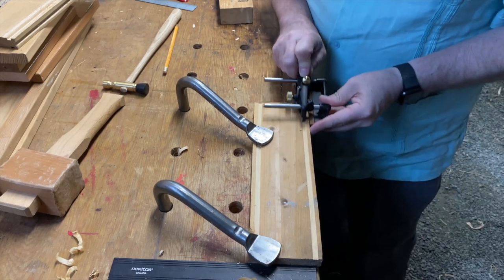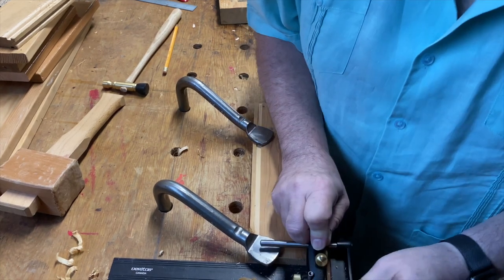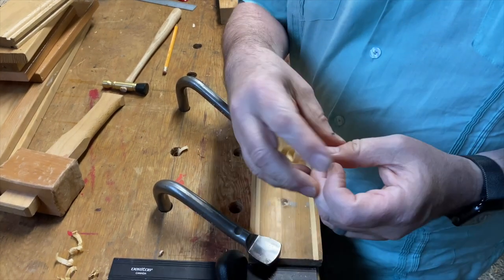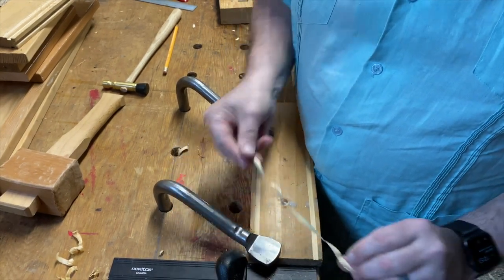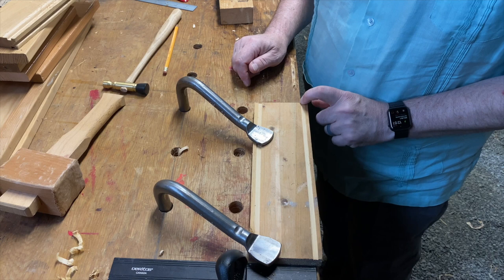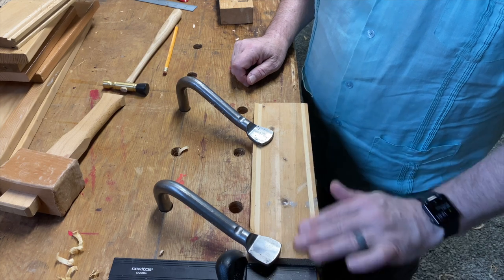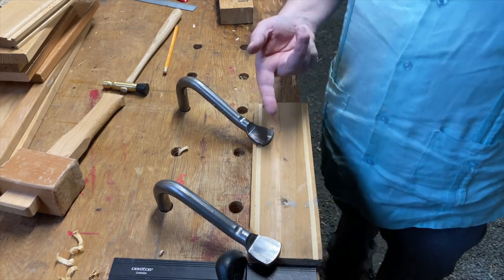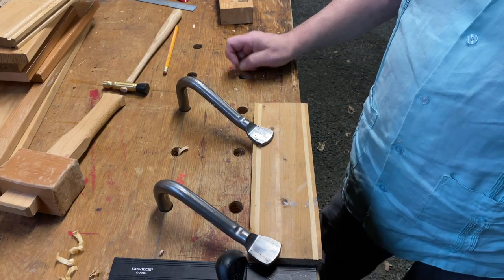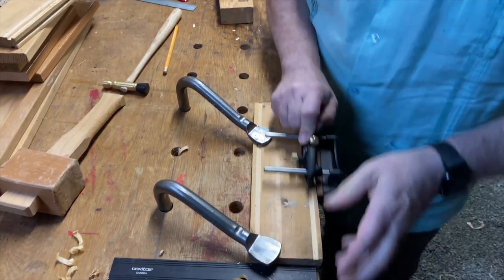This is old Douglas fir, a bit of a trim board left over. As you can see, we're getting really good shavings all the way through — full length shavings — and the line is perfect all the way along. There is no step, no little shelf, there is no tear out along the edge. If I take a thicker shaving, I'll get some tear out, but if you're just blowing through, this plane is perfectly capable of taking a great thick shaving. So there it is, cutting lines.